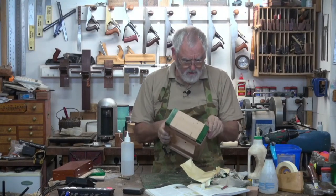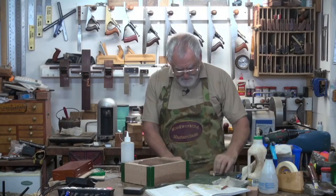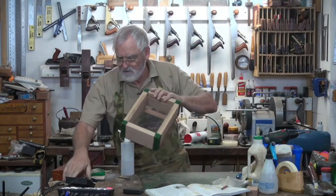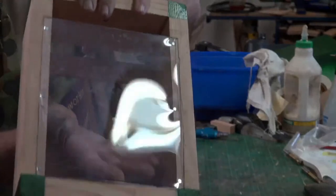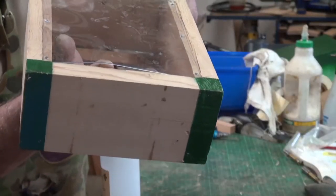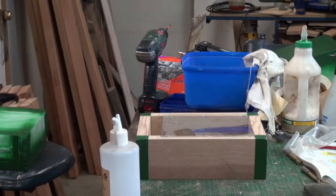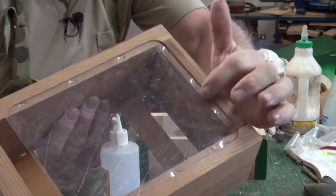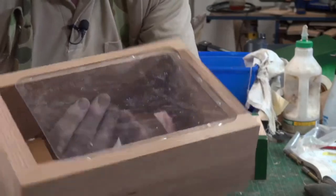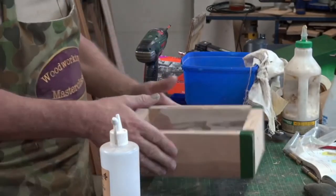In the book that Tim wrote and the one we just made, the major difference between mine and that is if you look on that inspection plate or the viewing platform, it goes to the end, which there's a bit of a gap there. You can see that poking up. Now, the bees will eventually fill that, but you can also run into a bit of problems with water getting in there if you get sort of horizontal rain. Whereas the one I do, which you saw me do then on the router, I actually bring it back so it's sealed on the timber. The bees will still come in here and fill that up, but it waterproofs it a fair amount. So that's something you might want to consider.